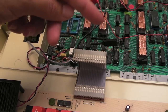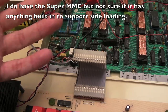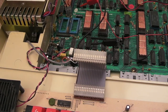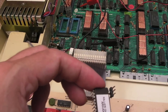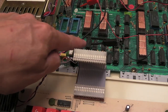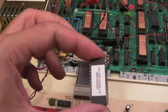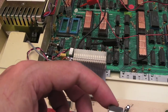I haven't got the DFS ROM in here at the moment, and I think that has some sideways RAM load and save utilities, so I'll need to get that at some point. I've ordered a 64K EEPROM ROM board that will hold four ROM slots. I pulled the jumper off and connected using little clips to the upper address line in the middle of that jumper set, and linked it across to the next connection down on IC76. Lo and behold, when I did *ROMS to list what the system can see, both games were available. So you can do that — you don't actually need the jumper.